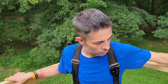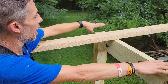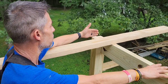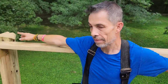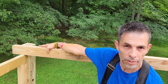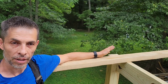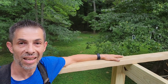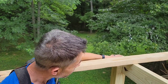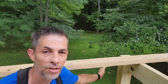I also had an issue where I planned on taking this 4x4 post up a little bit higher and nailing my rafter on the side of it so there was no seam or anything over here, just like I've done over here. See, this is what it'll look like from the outside. You won't see the post. But I didn't do that over here on this side. I'm not exactly sure why. I just changed my mind without even telling myself. We just did it, and then I was like, what'd you do? So anyway, that's the way it is now, and I'm going to set that on there. Now to cover the seam over here,